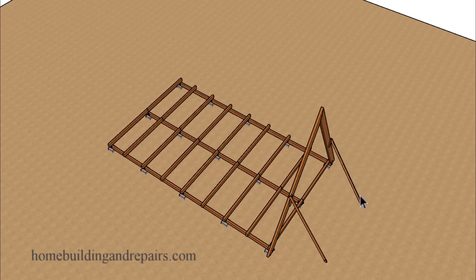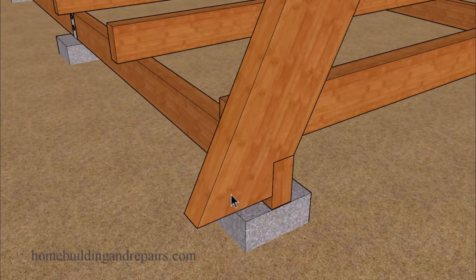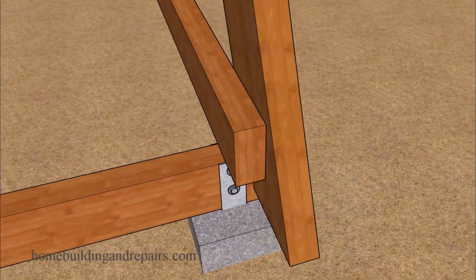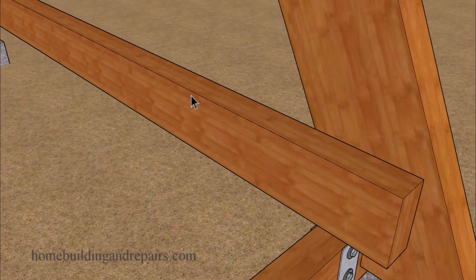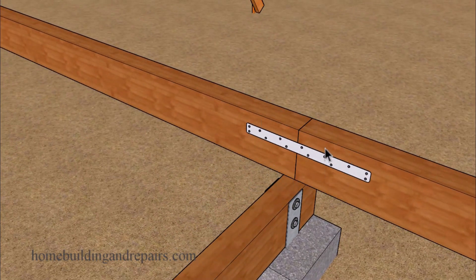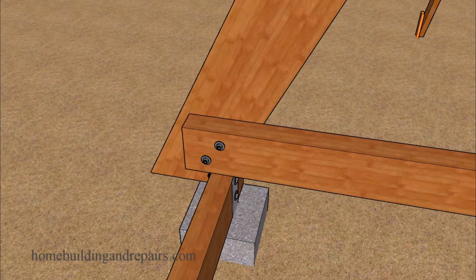As you notice, we're going to have a couple of braces here. You're going to need to plumb up this section of the building and brace it off at the sides. You can always change the bottom design of the rafter if you want to add some fascia board. You can see where the roof rafter beam is now sitting on top of the floor beam. You can use whatever you want here — nails, lag screws, and even other types of building hardware to assemble this, like a strap in the middle. I think the most common method will be to bolt this together.